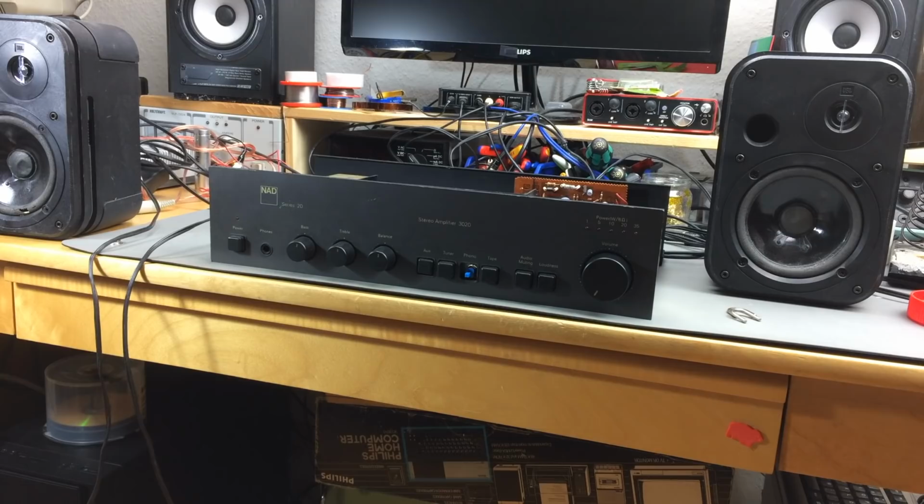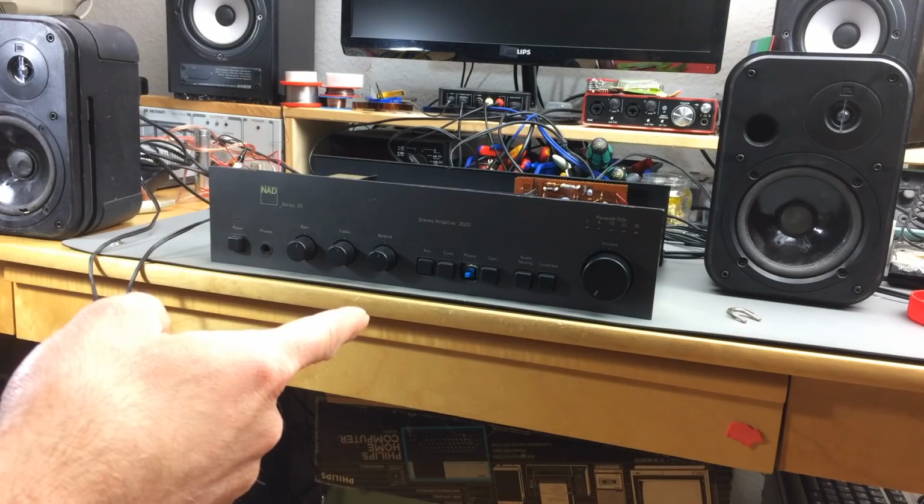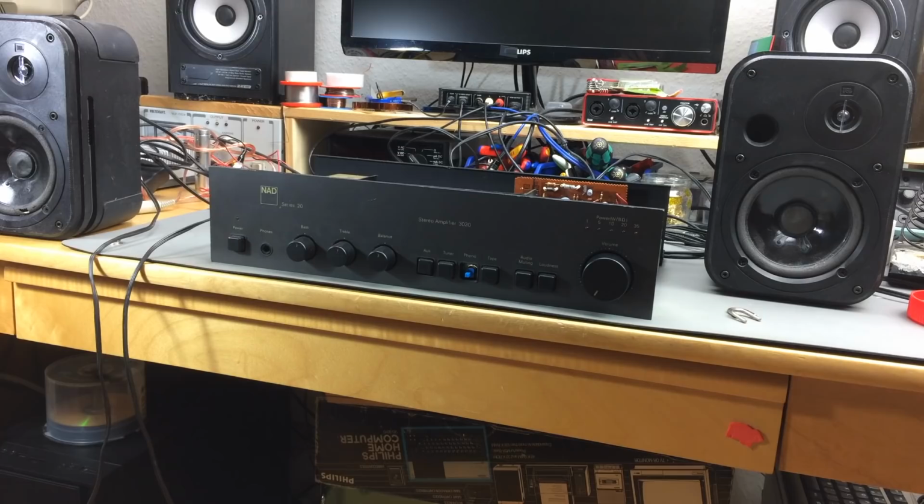So I think, I hope, really, that the issue with this is just many, many bad capacitors. That may very well be because this thing is pretty old and they run pretty hot, so the capacitors are pretty stressed in there. And as I always say, these electrolytic capacitors age, and sometimes they don't age very well. So I'm just going to give it a shot and order the capacitors necessary for this. And let's try if we get the other hum back with the jumpers inserted there.